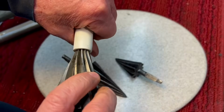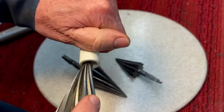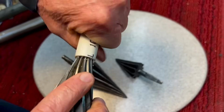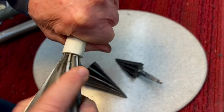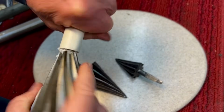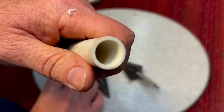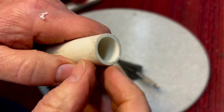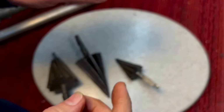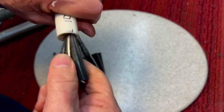And how you would use it is you would take it in here. Now, you see that sharp edge on the inside of that tubing? Well, you would take this like this, and look at the little shavings I'm making. You see the shavings that are coming up there? That's how you could tell this is a nice, sharp one. And you just twist it around, twisting the pipe back and forth. And if you use a brace, this goes much quicker, obviously, but I do it by hand. Now, look what we did. We softened the edge of the inside here. Very nice. We put a little kind of inside chamfer in. This smaller one will give you a little bit of a steeper angle, but again, that's what that does.